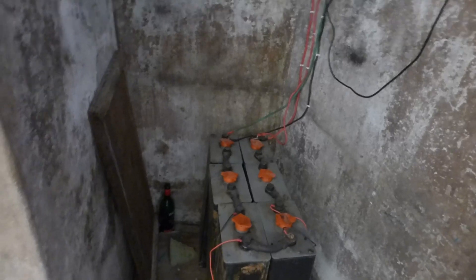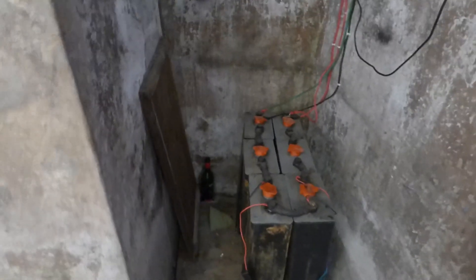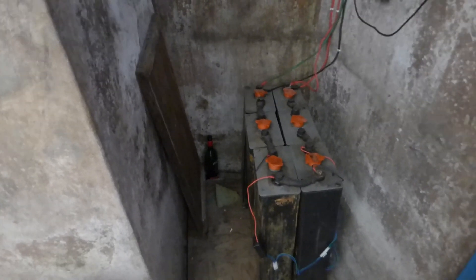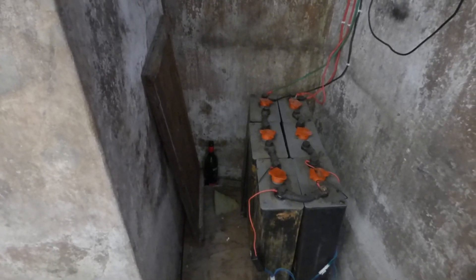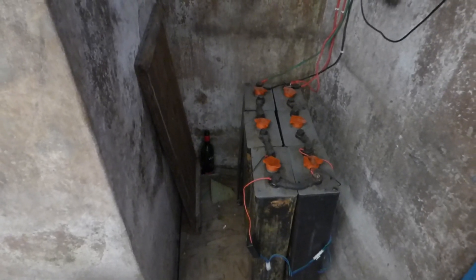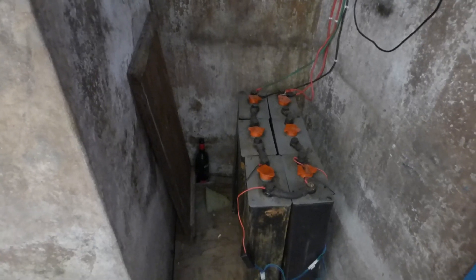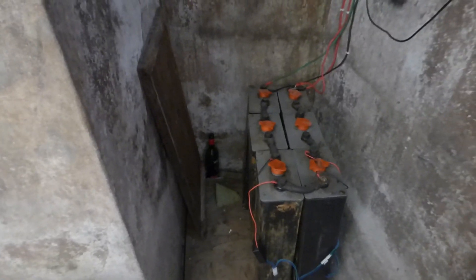I did the Epsom salt treatment — I put Epsom salt in some of the cells that I eventually sent to the recycler. When the recycler was pouring out the electrolyte you could see a lot of white, and that white was sulfation — some of these batteries were really badly sulfated. We can likely never recover full capacity, but if you think about it: 750 amp-hours is close to 9 kilowatt-hours in batteries. If I could get one or two kilowatt-hours out of them every night I'd be a very happy guy. The goal is to recover enough for people to use through the night — charge their phones, maybe run their fans — then the next day turn everything off, charge it, and keep repeating the process.